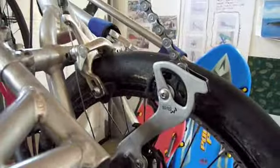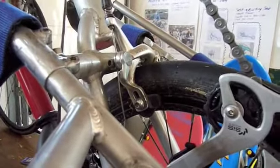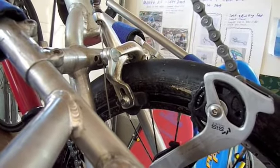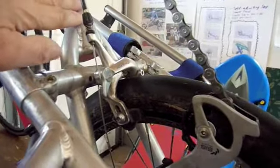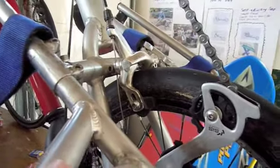Now notice the chain lines. You've got to be careful about chain lines on the bottom and on the top relative to the footrest, and you also have the second brake coming through there. So that's something to be considered. So, again, supporting here makes sense, and supporting here is probably where you can consider going. I'll just take a look at the bike.